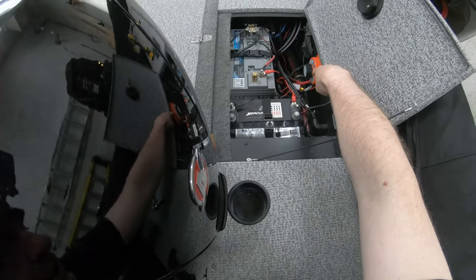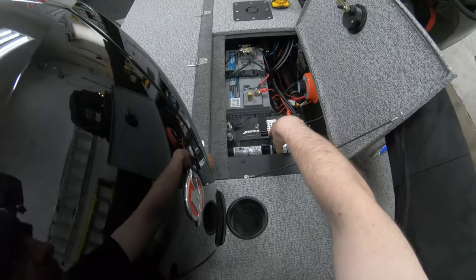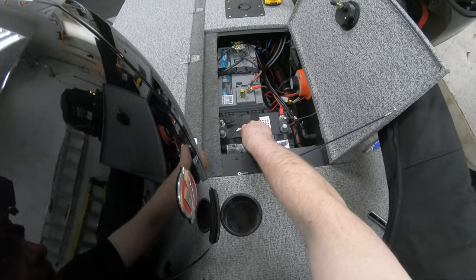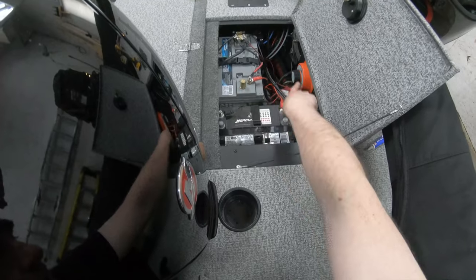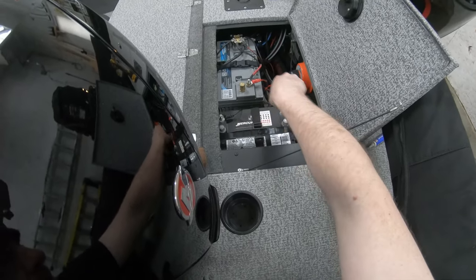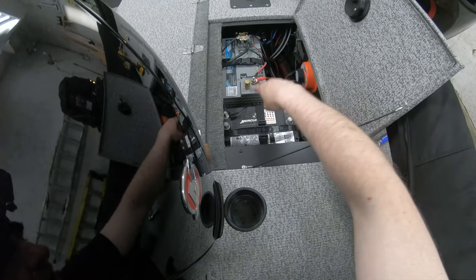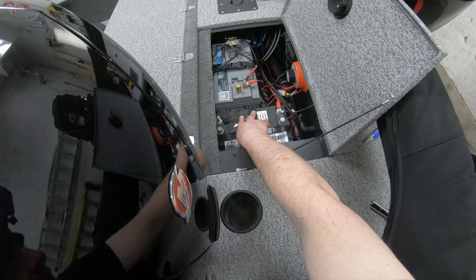Keep them on a switch, put the 135 amp hour over here, and run all of my sounder electronics into here, and run it off of this all day. And generally speaking, the boat will be recharging the AGM, but I will have the option to go to both if I want to join them both together, or just run everything, and then I'll use the battery switch for that. That'll be later this summer. We're gonna rewire and clean up in here a little bit.